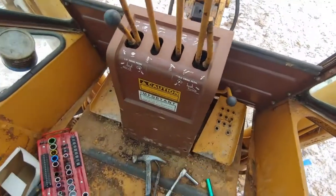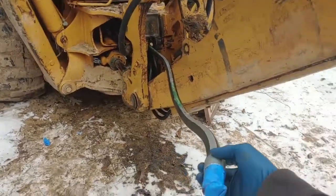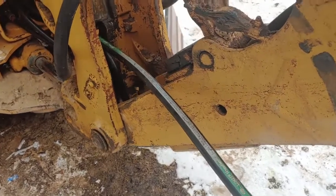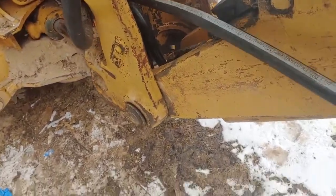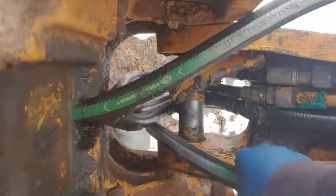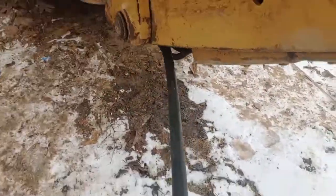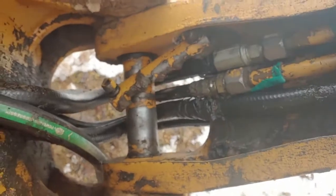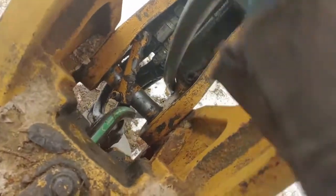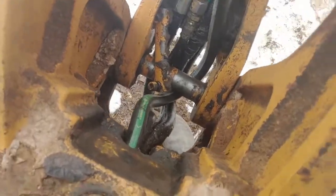Then I'm gonna throw on this plate. When installing the hose you're gonna want to leave it straight out so that you can properly turn the hose while installing it, otherwise you'll run into torsion problems. We're gonna feed the hose down through everything. Make sure your hose is routed properly — a misrouted hose is extremely likely to get unnecessary wear and tear and possibly break.